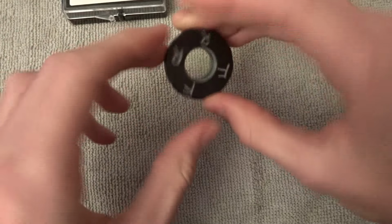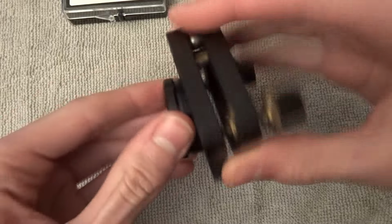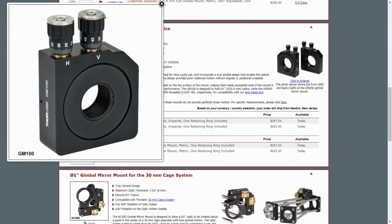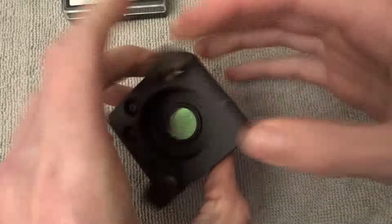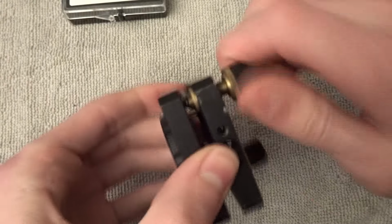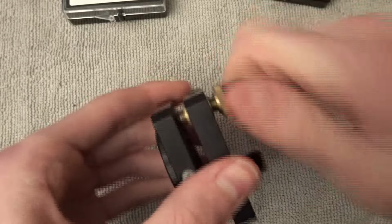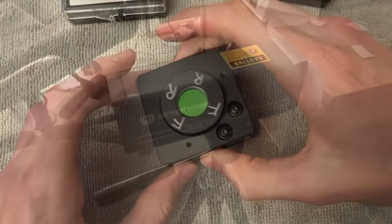Because the two mirrors need to be made very parallel to each other, they must be placed in some kind of adjustable mount. The really nice ones have vernier scale micrometers on the adjusts and other features, but for the home shop budget, this more common style of mirror mount should suffice. I also got these from Master Laser, but they are available elsewhere. I think they are made for like CO2 laser cutters, so look around at hobby CNC places.